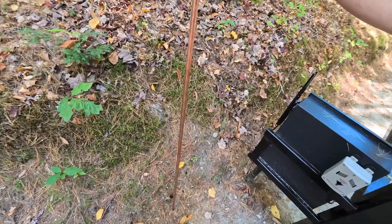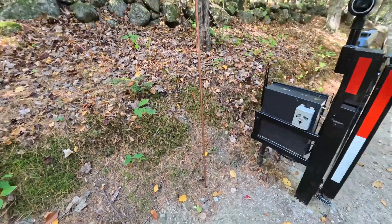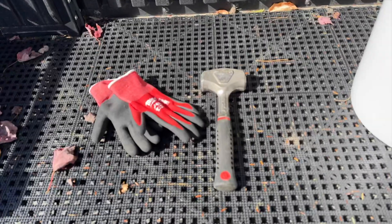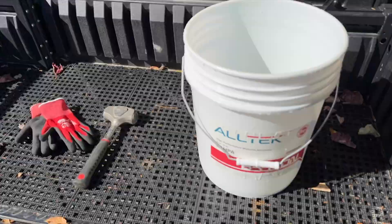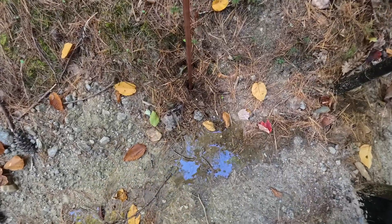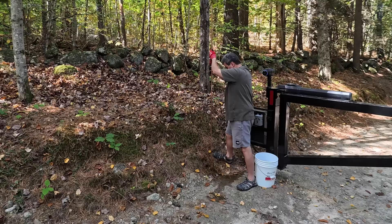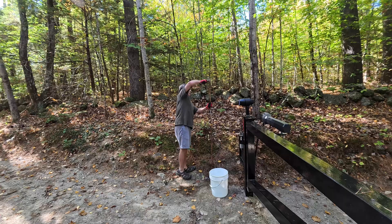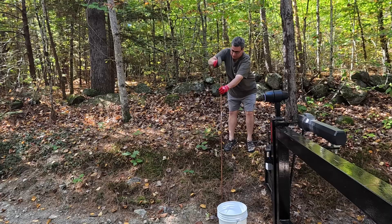To get started, we've got to pick a spot to install our grounding rod. I'm going to go about four feet away from the gate, and from there I'll run one copper wire into my box to connect my network equipment. We've got to drive this 10-foot grounding rod into the ground. You don't need to rent any tools — just grab a small hammer or a sledgehammer if you've got one. This mini sledge is going to be perfect. The one trick that really works is to grab a five-gallon bucket of water or a hose and soak the area you're going to drive the rod into. The water acts as a lubricant — it softens the ground and makes driving the rod in a lot easier.